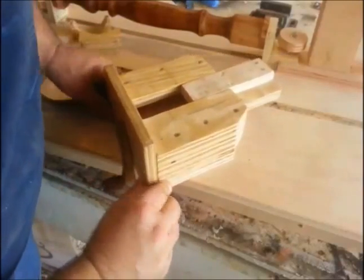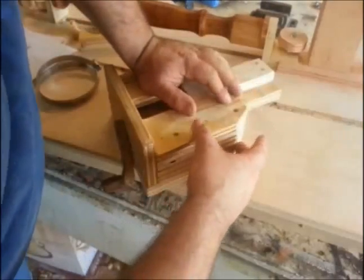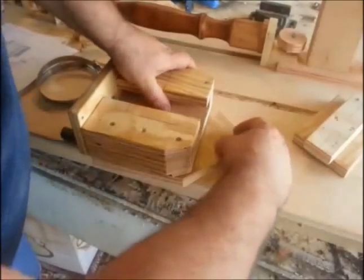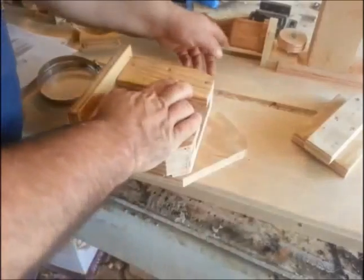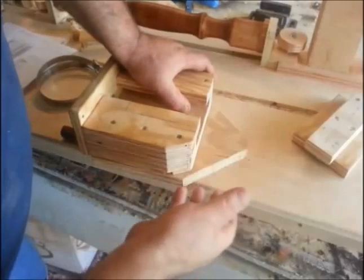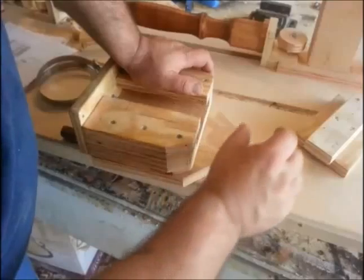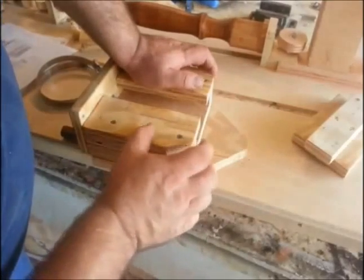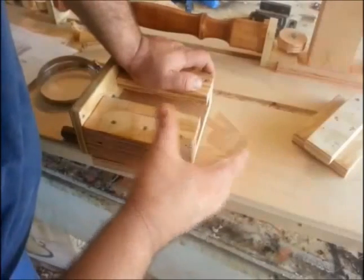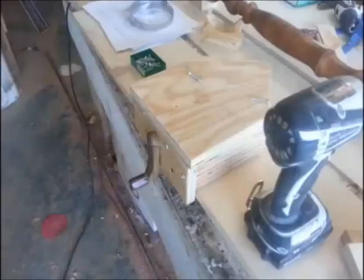I can put my router mount back on here, and my pin for following the guide I'm going to mount right in front. That pin will just follow the guide, and I'll make a slot so I can put different size pins in for different size router bits. My plans have a different mounting system — it mounts up on the top bracket and comes out either way — but I'm going to do it this way because I already have the sled made.